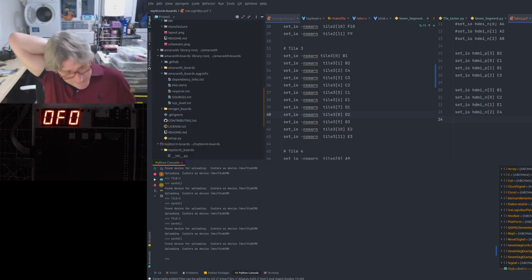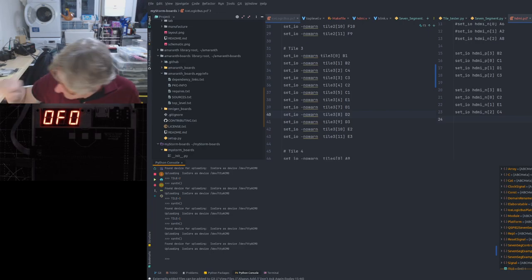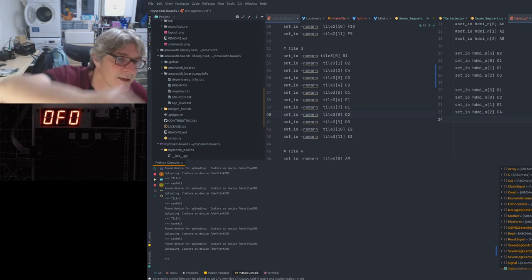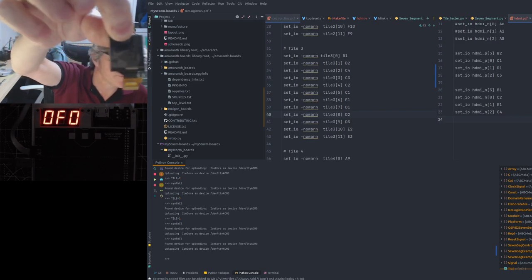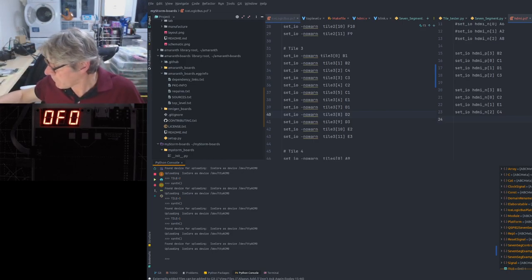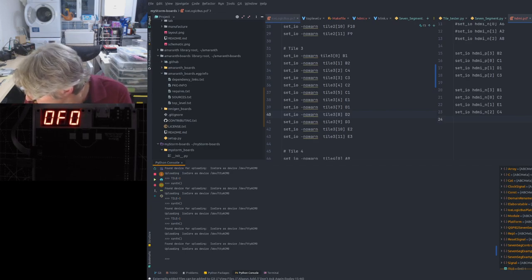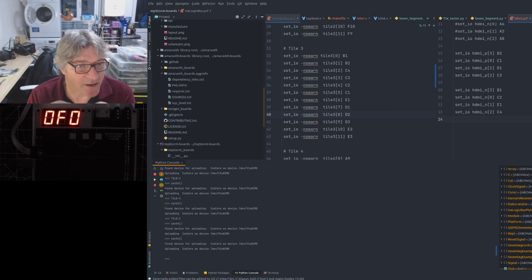The prototype blades I've ordered are an LED one. There's one that will hopefully fit these kind of small LCDs, maybe OLED. I'm also doing one for the ESP32 C3 mini on it. And one of the blades has a dual row 5-pin header on it, I think, which is just like a microblade breakout, effectively. Good for connecting to a logic analyzer or something.